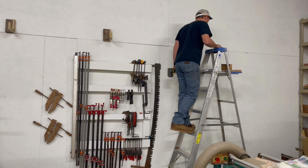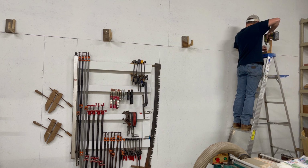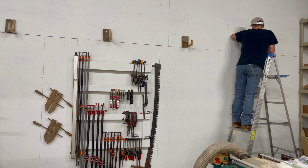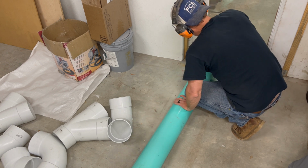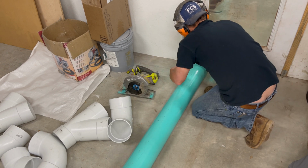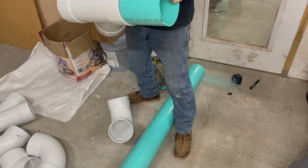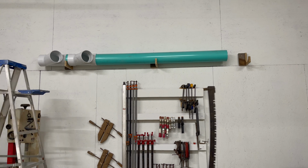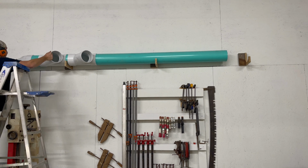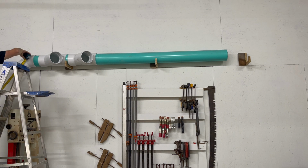But a basic thing that I've found is how many CFM I actually need at my tools. So I mentioned before, my planer was just not getting good collection out of it. It was because of the lack of CFM. And again, quoting Bill Pentz, we need to move about 800 CFM of air to get good fine dust collection. And I wasn't even getting chip collection out of mine. So hopefully with this new dust collector, I will be getting somewhere near that.